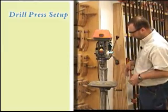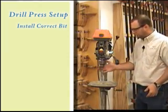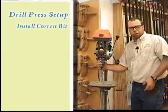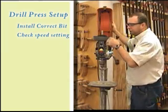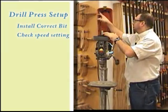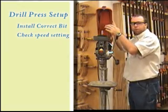So that's the setup for drilling a hole. First thing I want to do is make sure I've got the correct bit installed — we're drilling a half-inch hole this time. It's centered in the chuck. I'm going to check my speed setting, and most of the time in our workshop it's going to be set for woodworking. If you have one at home and you're working with metal, the speed would be different — it would vary. Most of the time on your cover there's a gauge or a chart showing how to set it up for the correct RPMs.